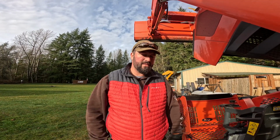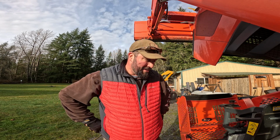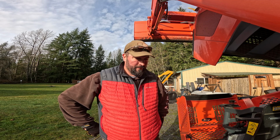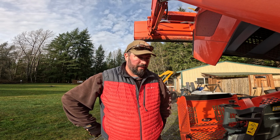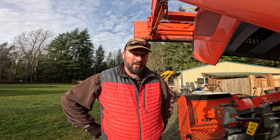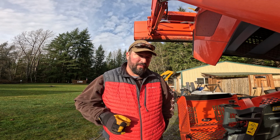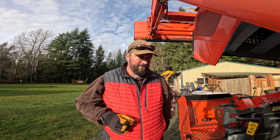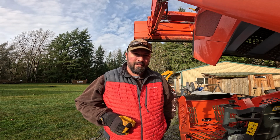All right, well, that seems to have fixed it. Now you know, it's a lot like a car. When it squeals, it's probably the fan belt. I am a little concerned that it loosened up. The tractor just got serviced less than 10 hours ago. It was his first service. It's 50-hour service, or 60-hour service. I'm a little concerned that there's a bearing in there on either a water pump or the alternator. There's just a hint of a squeak in there. It probably doesn't come through on the camera's microphone, but there's just this little hint of a squeak in there that makes me a little pensive, I guess is the word. But we'll go ahead and get the cover back on and get back to work.